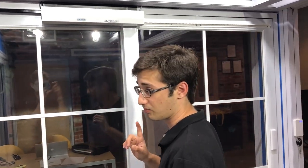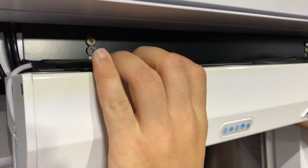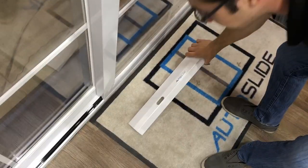We're going to get to programming the push button now. First thing you need to do is take off the cover. Put your fingers on the top of the unit and your thumbs on the bottom, behind it. You pretty much want to peel off the case so you can access the motherboard, then click the sensor learn button, which is right here.